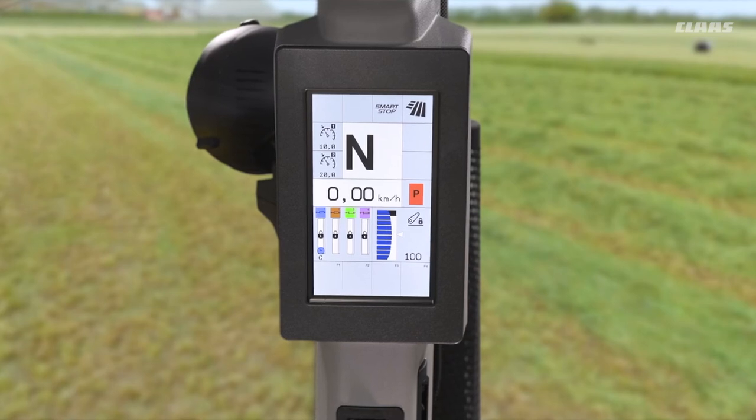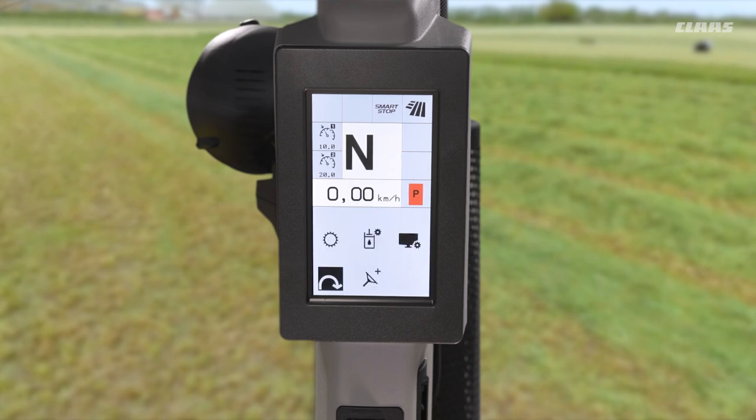So now that we've recorded our sequences using our CSM switch on the right-hand control panel and our function key buttons and our stop buttons on our armrest, what functionality can we actually see through our CIS Plus display? Well, very, very simple in relation to our CSM in a CIS Plus machine. We have the ability to see what each sequence can do for us in terms of the steps that are within them, but we have no ability to edit the functionality of each sequence. By that, we need to move up to a CBUS machine to gain that level of functionality.